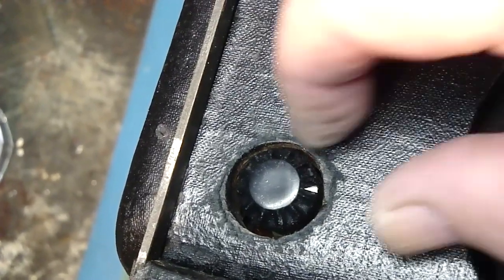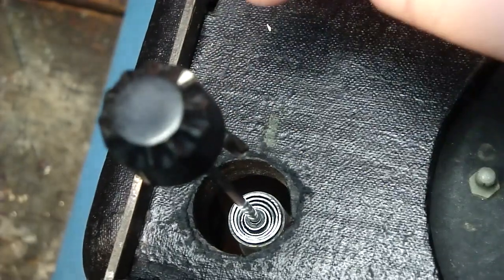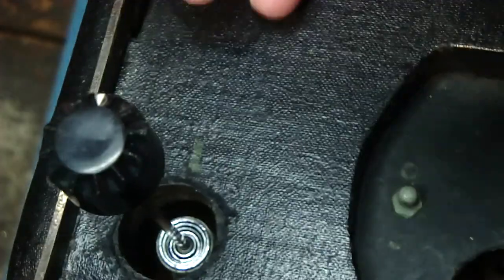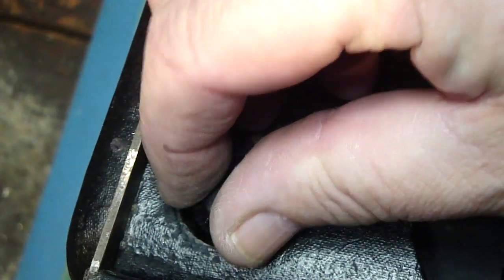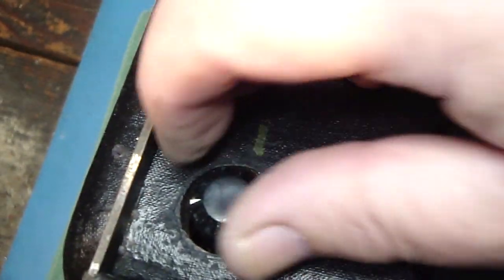You may want to pay attention when you're tightening these nuts down, because the antenna itself, see now this is just the way you want to have it. So when you turn it toward the front, this thing pops out, but then you turn it, say 45 degrees either way, it'll go back down until you bring it back to the front, and it should pop up. So as you tighten it down, sometimes it'll want to wander either this way or this way toward the front of the radio as you tighten it. So keep that in mind as you're tightening down. Also, just leave yourself at least 1/8 of an inch around, so that you have some clearance for the top of the antenna tip. So, and life will be good.